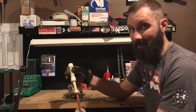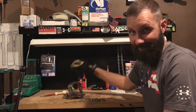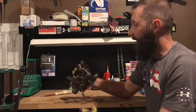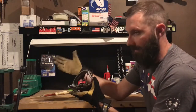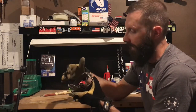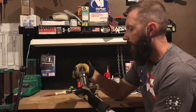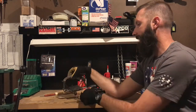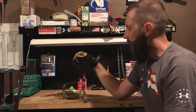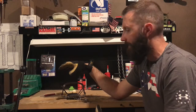So it was a matter of ounces. I mean, it was a hairy trigger. It was a little spooky setting it, to be honest with you. But obviously I looked at it and knew what needed to be changed in order to address that. So I took a file and filed back a little bit deeper notch. And it looks like I may need to file a little bit more to get that notch just a little bit deeper, because we're almost to 2 pounds, which to me is pretty dang light.